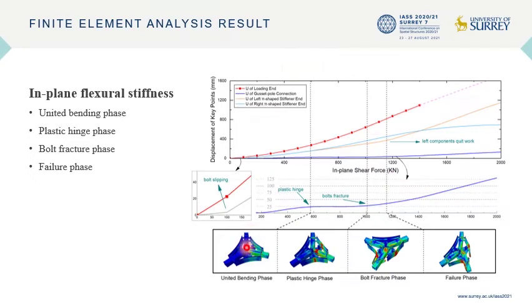The loading pole can be regarded as a cantilever, hence the in-plane load is mainly transmitted to the two near pie-shaped stiffeners by bolts averagely along invariant directions. When the section shows plasticity completely, the plastic hinge appears, which leads to the second phase, the plastic hinge phase. Simultaneously, another plastic hinge generates at the left pie-shaped stiffener. Before that, the curvature of it has disappeared because of the shear.